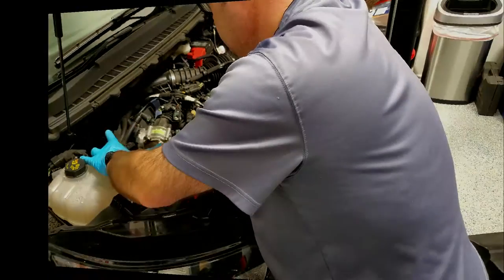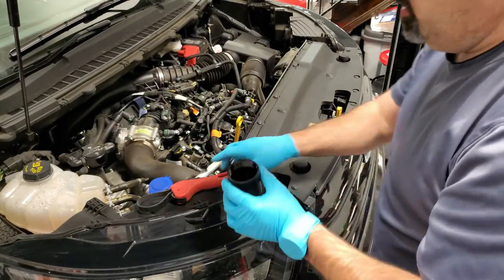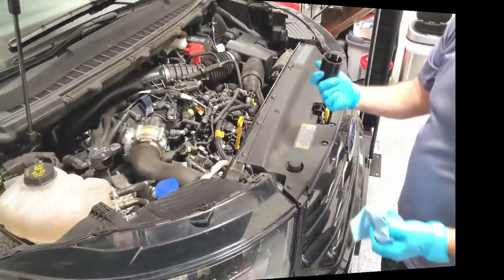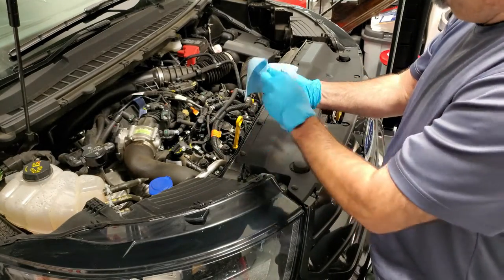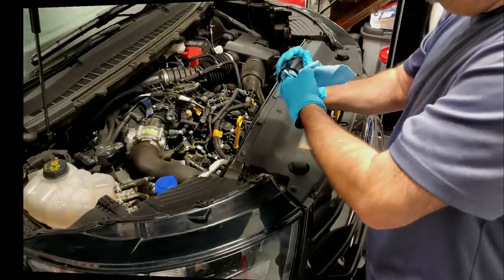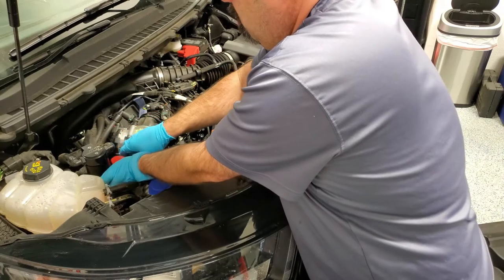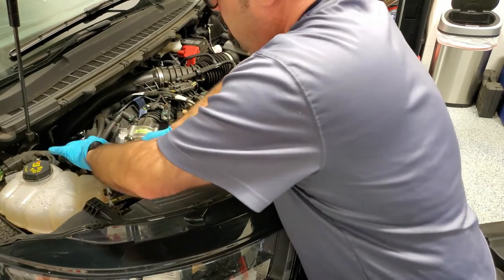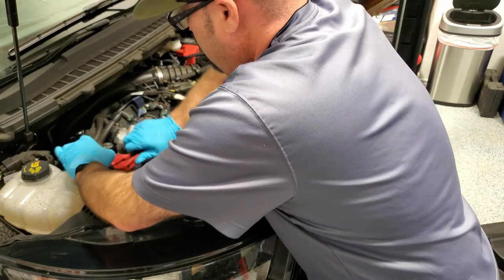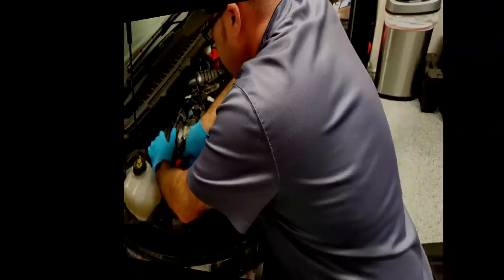It turns off pretty quick, pretty easy. About a quarter full, something like that — pretty dark oil in there. On the oil separator, once I dump out the old oil, I usually just take a blue shop rag, something that doesn't leave lint behind, and give it a quick wipe. Super simple. Usually just maybe a full turn or so — I just hand tighten it.